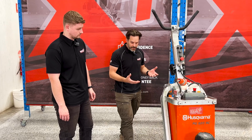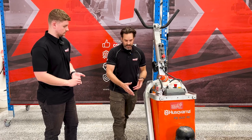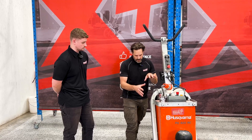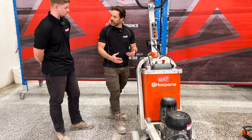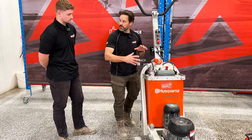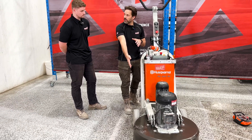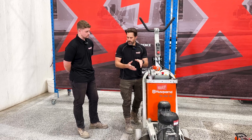The angles on the chassis are the same, the way that the box mounts up is the same. But one thing you can't tell from the outside is that these tubes here are actually filled with solid steel to give it additional weight for the wheels to make traction. This is both an advantage and a disadvantage. We're getting better traction on the wheels, which is required — for a same direction rotation machine you need a lot more grip to keep it going straight. However, the weight happens to be partially behind the wheels, which means we're actually losing down pressure on the discs. While the machine's gained a few pounds, it's actually lost a bit of weight on the head itself. As the grinding game is all about power to weight, we actually lose a bit there.